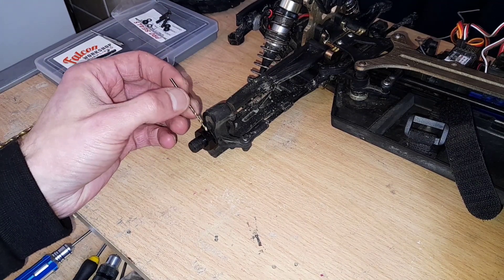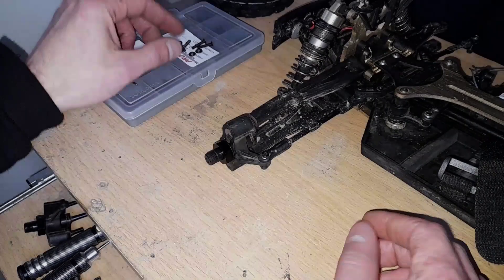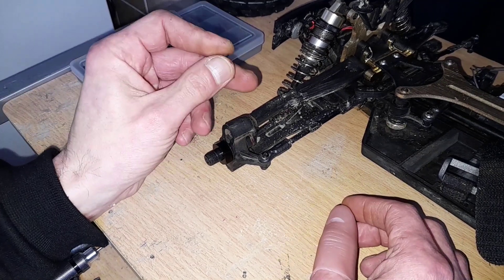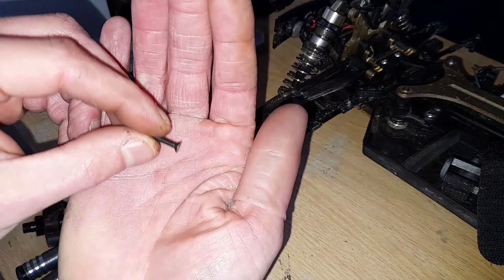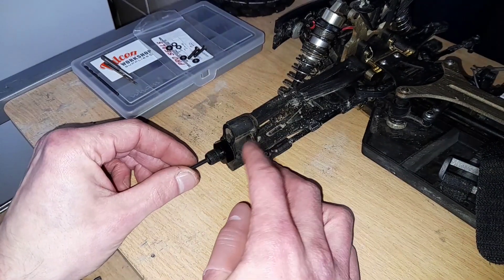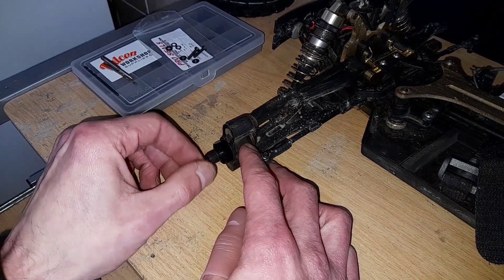Find something of similar size but it's got to be like a star shape. When you put it in, just lightly turn it and with your fingers you'll feel it start grabbing those rough edges. Once it grabs on, get a hammer and start striking — that'll actually start forming into a new head. What that allowed me to do is get enough grip that the pin came out.